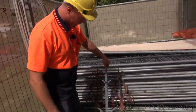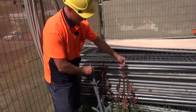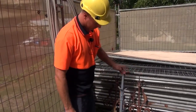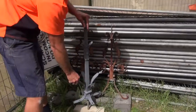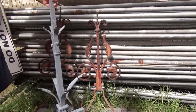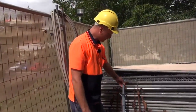These are the finials. As you can see, these are the rusty ones from the dormer windows. What we do is we wire, wheel, rust treat, and repaint. And you can see many of the elements are still rusted. But as a conservation point, we've done what's necessary to maintain the original fabric.